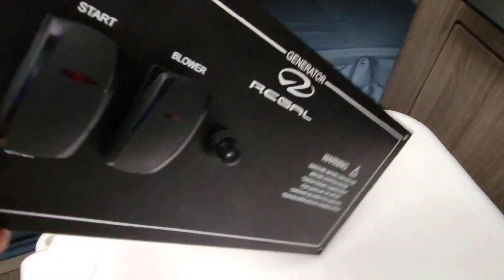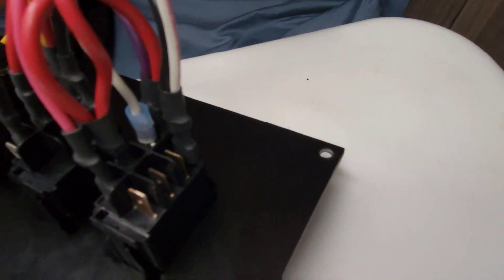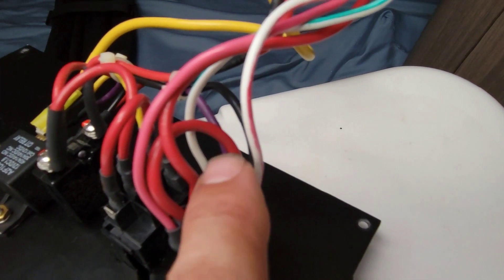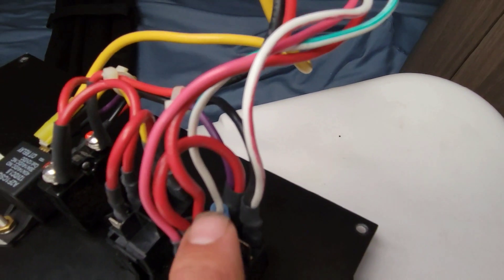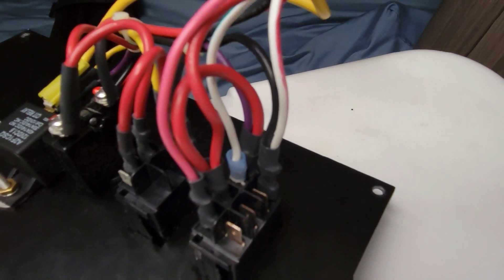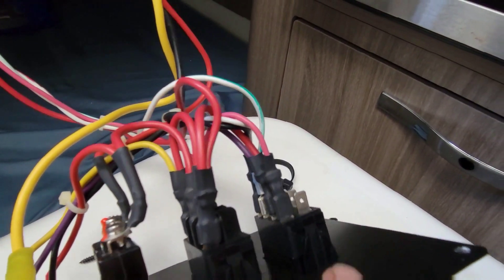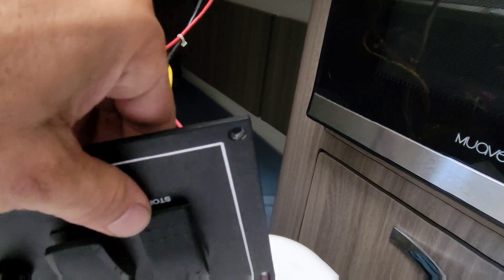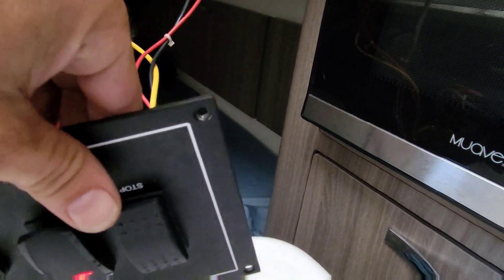Alright, these switches are pretty simple usually. Let's take a look and see what kind of wiring we've got here. So it looks like this pink wire should be our light wire that lights that switch up, and our white wire should be on our stop circuit. It looks like we have power to it like it's supposed to, power to your start circuit like it's supposed to - but our white wire and our pink wire are backwards. Let's switch them and see what it does. Alright, we got our wires switched back the way they should be. Hit the start button. Alright, it started up no problem. Now let's see if it shuts off. Alright - good, that was just the wires being crossed. Not a big deal, it happens sometimes.